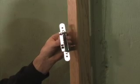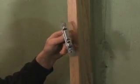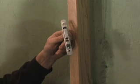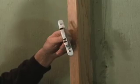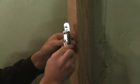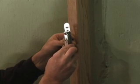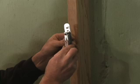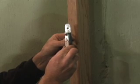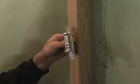Now, although I have the instructions for this mortise patio lock, I'm not going to use them. I'm going to pretend like I'm reusing an old mortise lock that came out of an existing door, and I'm putting in a new one. The best way to figure out the thickness that you need for this mortise lock is to just take a spade bit and lay it right over top the widest part of the lock. You want it to be just slightly bigger than the width of the lock, but nowhere near the thickness of this little lip here on the edge.